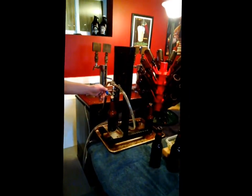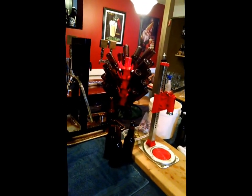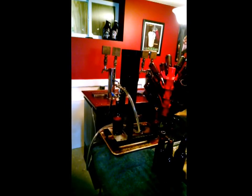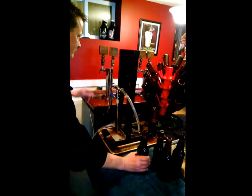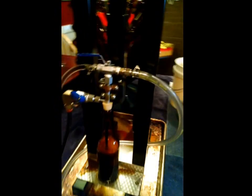We just have this line going straight down off the end of that valve into a bucket, though you can put it into a jar if you want to save it. As you can see, it fills right to the top. A little bit of foam that comes up pushes out any excess air. One person can do it — you can reduce the output so you have time to go over and do the capping, then walk right back and you're still filling. You can control that fill right here just by putting a little more back pressure; it'll slow right down.